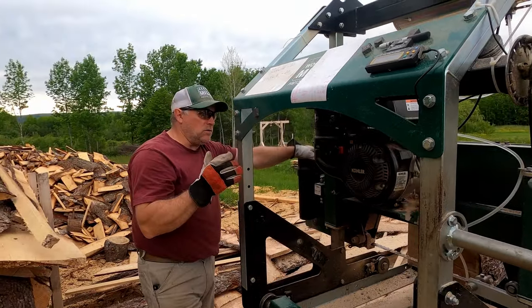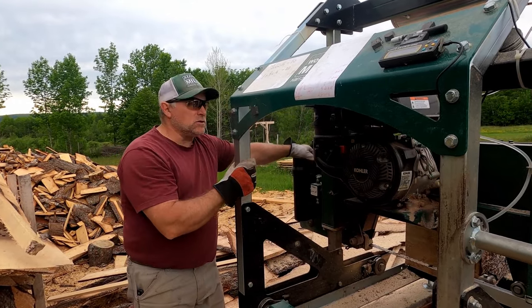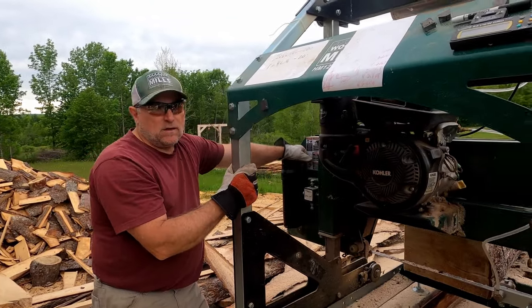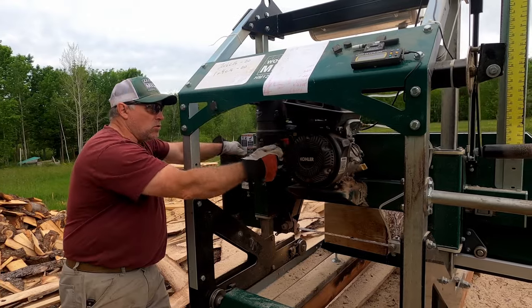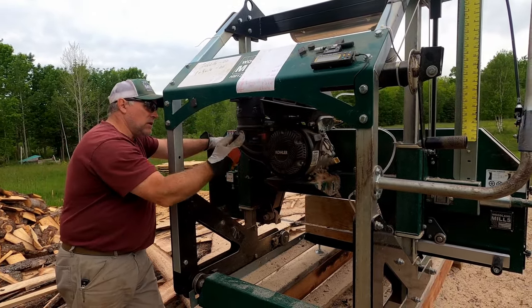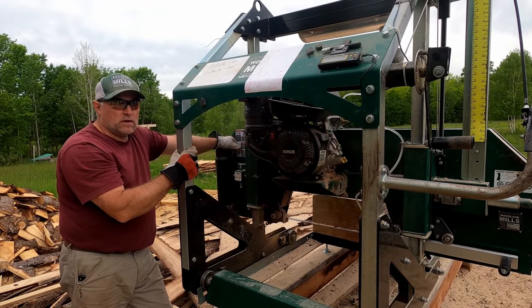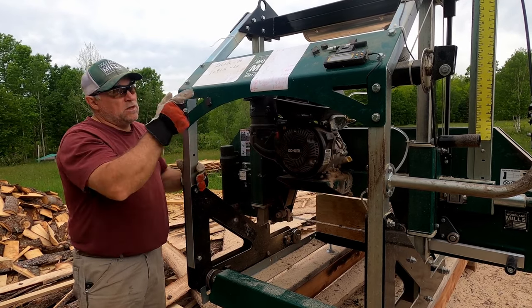I'm not telling you that you don't know how to run your machine. And I know perhaps somebody out there is going, well, listen, I've started motors my whole life and never, I get that. But this is not one of those motors. This has a motor with a pull cord right by your fuel shut off. So you have to go a little slower and you have to bring it back in with your hand. Do that, you won't break it off. That's what I do anyway, and it's always worked for me.